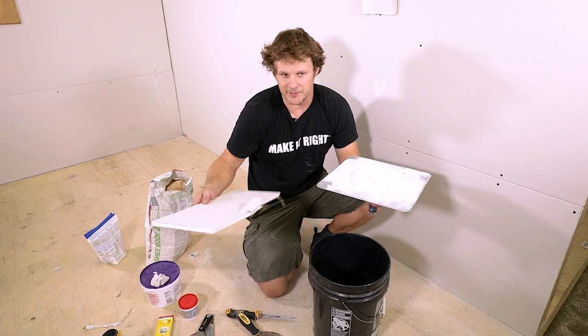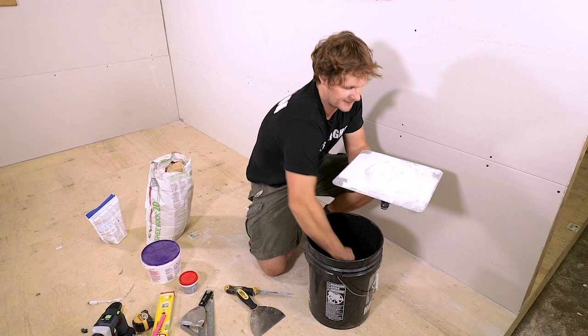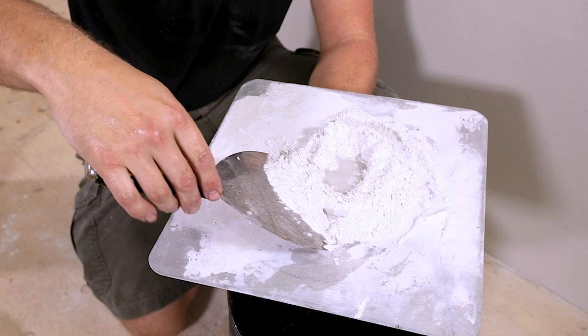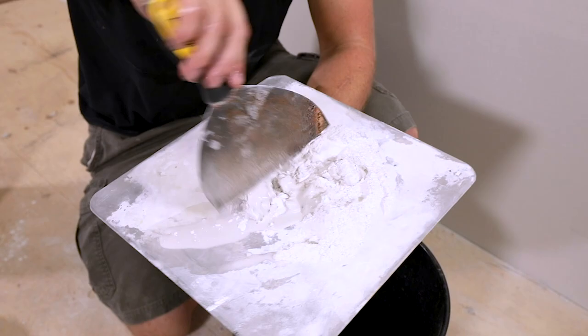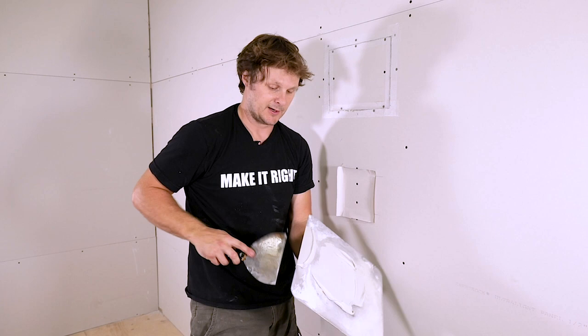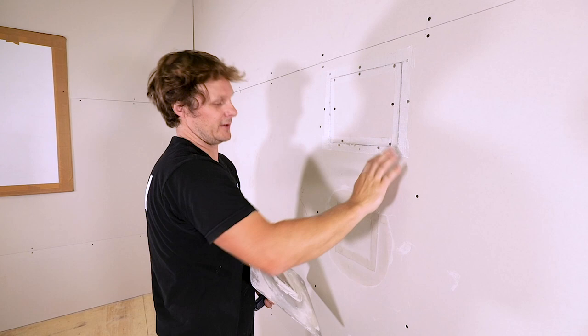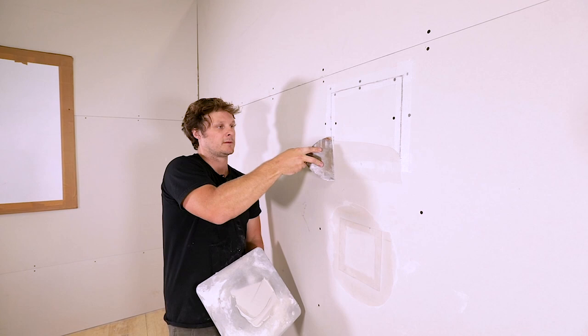I have a hawk — this is what I use, I'm comfortable with it. You could use a piece of drywall, make like a little volcano, mix it together; you can also get a little mud float box to mix your mud in if it's easier for you. I'm just going to add some water to the center of this and mix it in. My compound here is a 20-minute set, so it's going to set pretty quickly and I can get a second coat on and be done the job today. We want to fill all the mesh tape and just fill a feathered joint all the way around it so it's easy to flare out with the trowel on the next pass.